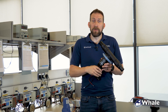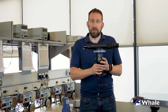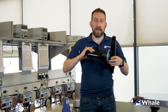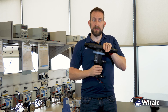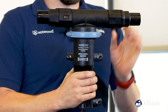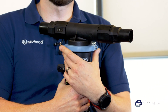The Gulper toilet pump can be mounted in really any position, but there are two things we always recommend. First, don't mount the pump facing up — always install it on its side, upside down, or even face down. Also, the head can spin 360 degrees, so if the default position isn't suitable, just loosen the two screws on either side of the clamping ring, turn the head to where you need it, and tighten those screws again.